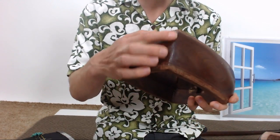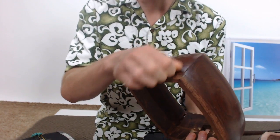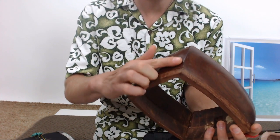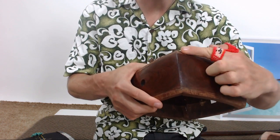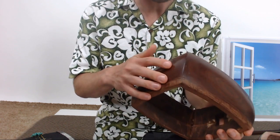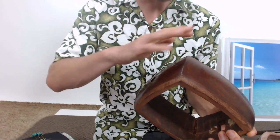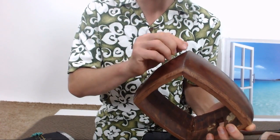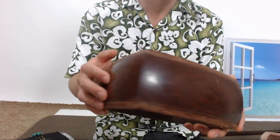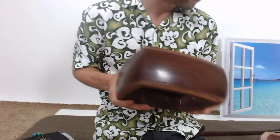However, if you don't want to damage the finish, I used epoxy for this. If you don't want to damage the finish, you can put wax just on the edges right here. Like here and here. Right up to the edge. And then when it's all hard, after the epoxy is cured, it's hard to remove, but use a heat lamp or a hair dryer or something, melt the wax, and then the epoxy comes right off. So that's pretty fun. Oh yeah, the Sanjet compound, that's going to be fun for this one.